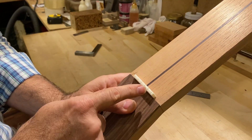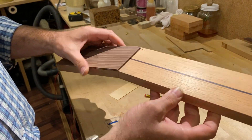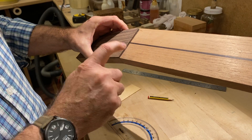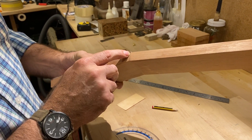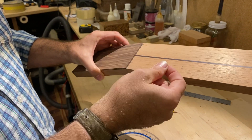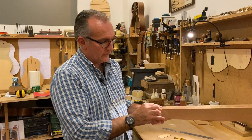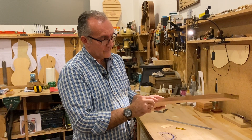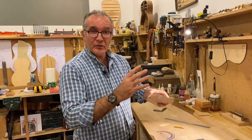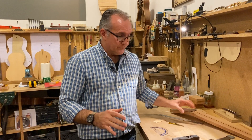As you can see, we have a very clean cut which is 90 degrees to this face. We've got a little bit of damage from the saw cut at the corner, but it's well away from where the neck will be — the neck will be as wide as this nut, so all of that will be excess. It's actually not a difficult job, and there are a few little tricks to protect the neck and avoid cutting through into the cedar. And that's all for now — hope you find this helpful, and until next time.